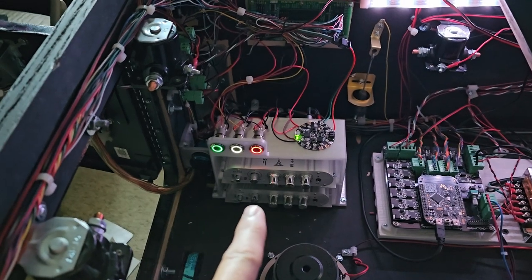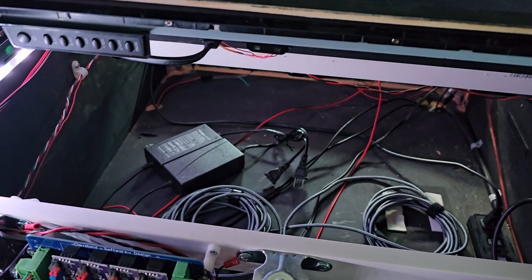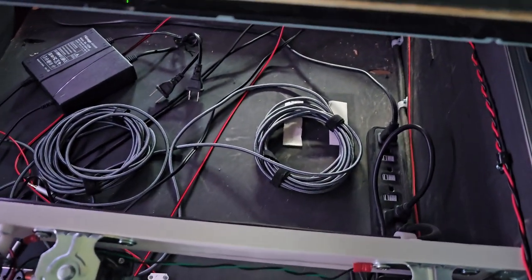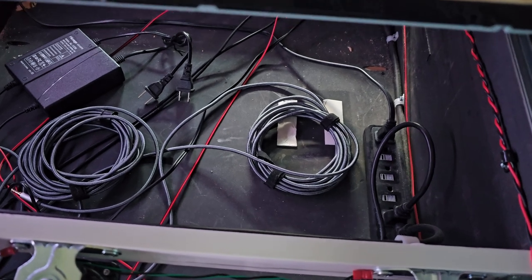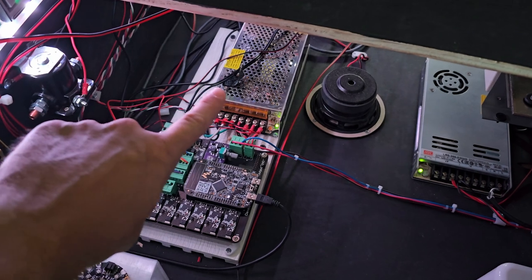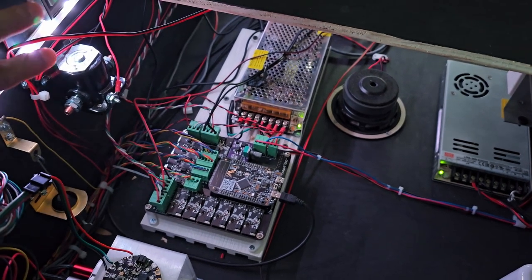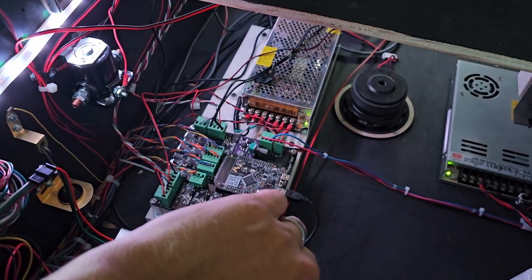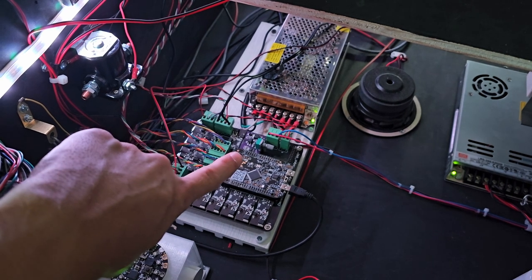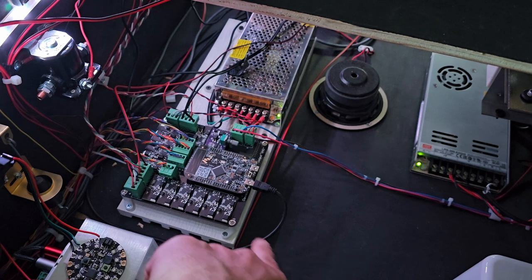The amps are all wired up. Now that I have a light in here you can see the issue in the back — there are power bricks everywhere, and my power strip only has three ports open. I have six different power supplies. This power supply down here is a 110-watt supply powering everything for DOF — all the solenoids and the shaker motor. Even though 110 watts isn't needed to power all of these simultaneously, I'm going to assume everything for that is going to be 110 because I'm going to have a CSD expansion board in the future.